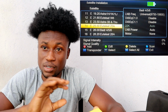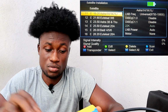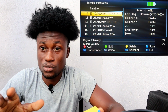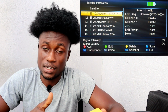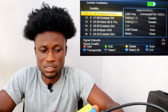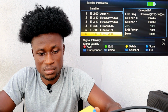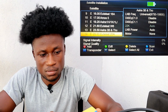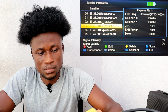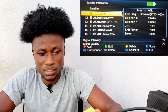With a MULTITV installation, we have every TV company and the satellite that their channels are on. With MULTITV, their satellite is Astra 2A, 2B, 28 degrees. So if you don't want to confuse yourself that much, you can select the same satellite. Come here, select MULTITV satellite Astra 2A, 2B, 28 degrees. If you can't find the exact MULTITV, here we have Rutas at 20 degrees.